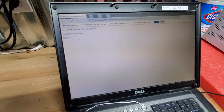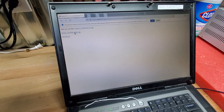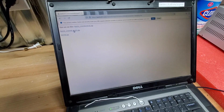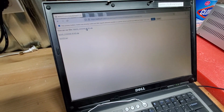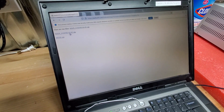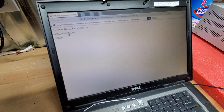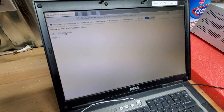Now if your firmware starts with 45 in the front — like mine, which had 45 in the U1 number — you're going to use that file. If it had a 69 you'll use the other one. If it has neither 45 nor 69 and you flash your device, you're going to brick it. Brick means that's what you can use the inverter for afterwards.